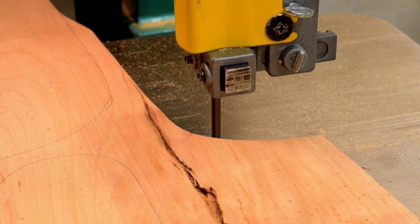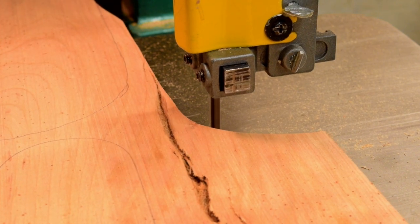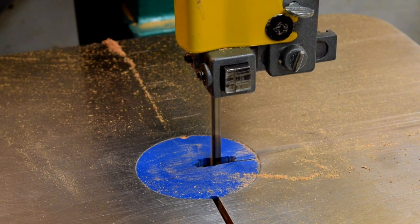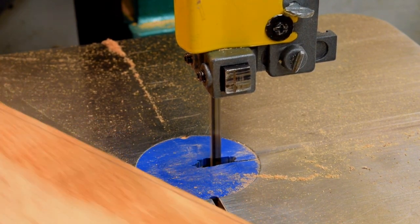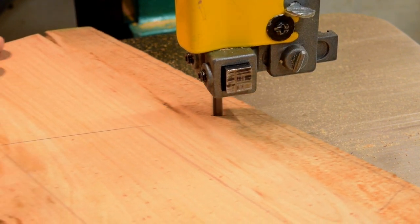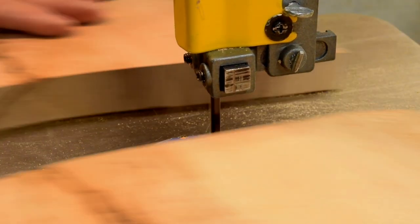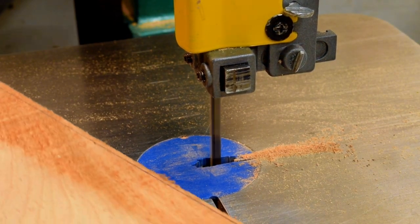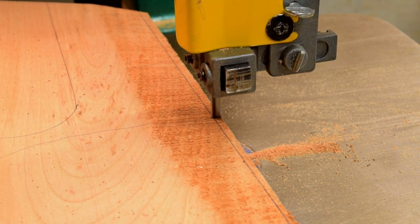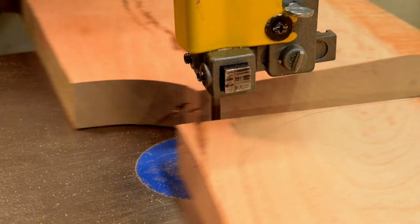As you can see, I tend to buy lower grade hardwoods. I like number one common usually, and often number two. Lower grades have more interesting figure and grain than the more expensive grades, which are designed to be free of defects and interest, actually. So I can cut most of my boards into fairly small pieces and work around these defects you see and enjoy the benefits of that beautiful grain. It's well worth it to me, and it saves me money too.